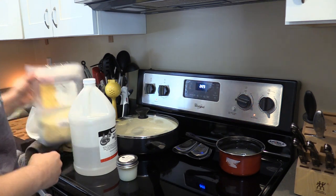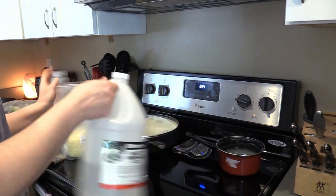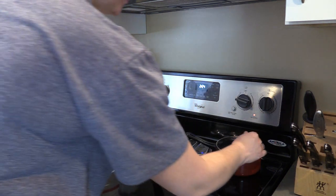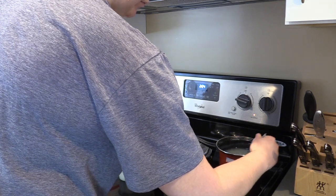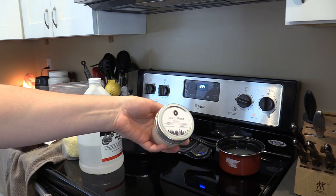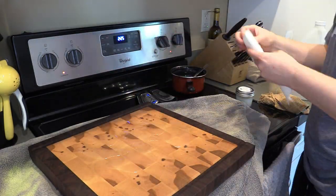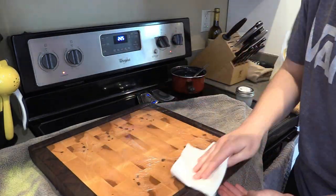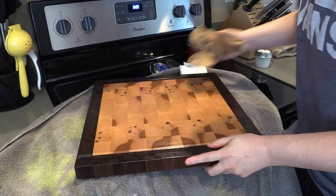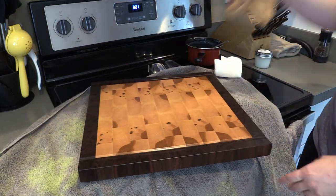I always keep a pot of this concoction ready — it's one part beeswax and three parts food grade mineral oil. You can put it in little containers and give it away with your cutting boards to help customers keep their boards in tip-top shape and advertise your business. I apply this very liberally and let it soak in for several hours. Once the board has taken up all the wax it wants, I wipe off the excess with a paper towel and finish by buffing with a nice soft cloth.